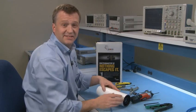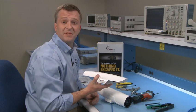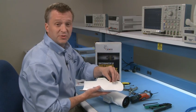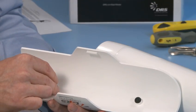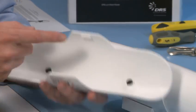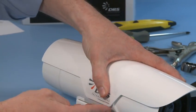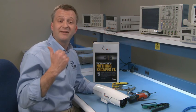The last step is to attach the solar shroud. The solar shroud provides shade from sunlight and will reduce solar loading. Insert the two stem bumpers into the shroud — just press them into place; it's a loose fit. The solar shroud has two protrusions that snap into the two channels on the side of the camera. Put one into place and then snap the other side into place. Your camera is ready to be mounted.